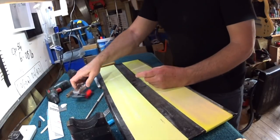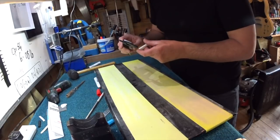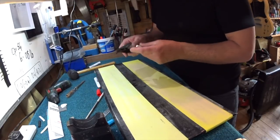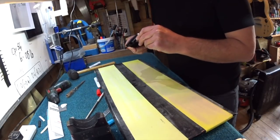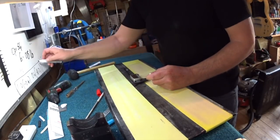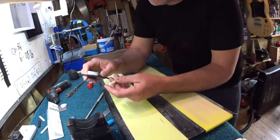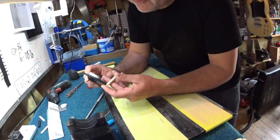7.6, and this one to lose 0.2 is going to go from, it's hardly possible we can get that in the slot. Okay, go from 8.1 down to 7.9 on the meter. That's interesting. That shouldn't be the case, really. So that's how inaccurate this measuring part is, because this really doesn't sit in that groove properly. The caliper isn't thin enough.